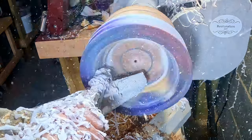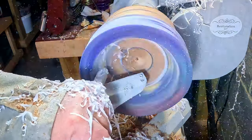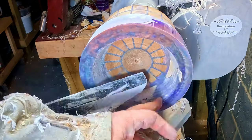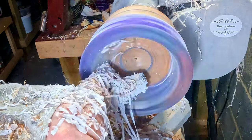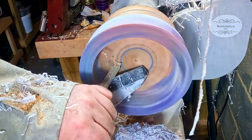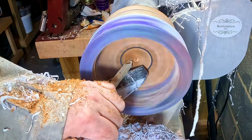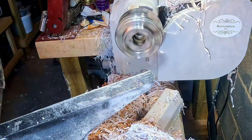It was all going very well — using the carbide cutter the resin sidewall was coming along nicely. I was a bit concerned about leaving waste block near the base, but with each pass it was disappearing. The only slight problem was the sapele segmented ring; it wasn't cutting so easily and I wanted to cut into it to reduce the weight. It was no good — I had to be more aggressive with the sapele, so I broke out the mid-sized carbide with a standard cutting head. I only managed three cuts before it grabbed and ripped the blank clean off the chuck, so perhaps the negative rake cutter was the better choice.